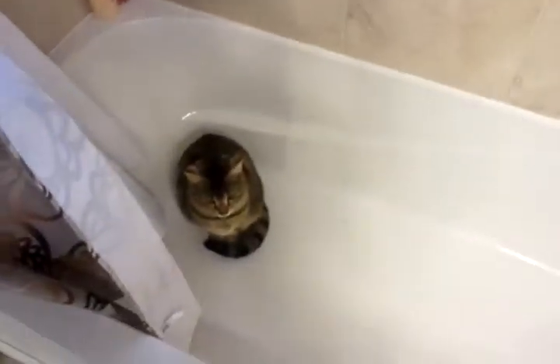I've been working on this for quite a while in stages, so I'm really proud that it's finished. I mixed the paint colors myself — a couple of shades lighter for the ceiling than the walls. All good paint, sealed the tile up myself, and put this cool trim around everything to make it square. Here's a handy tip: if you don't have a square room, at least make your tile job a little more square with steel trim that you can get in all kinds of different colors and sizes, so it's easy to tile up to and the tile guy doesn't charge you as much. Everything's sealed and waterproofed, and now the cat has somewhere to play since she's been locked out during construction.